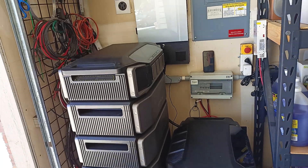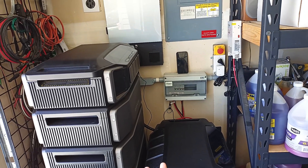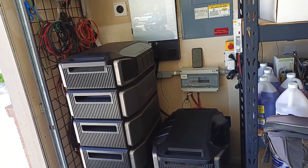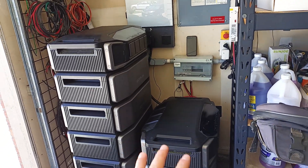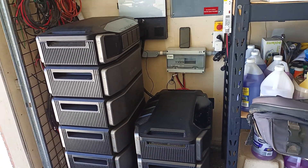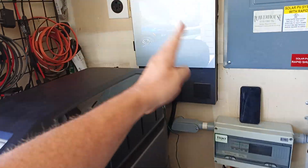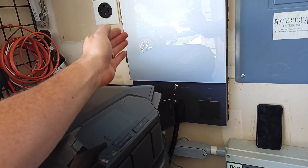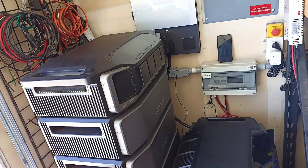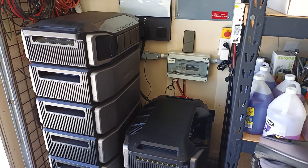Please send me any other questions or comments — I'd be happy to share my setup with you. If you want a one-on-one consultation, I'm starting to do those too, with specifics on the wire gauges and how I ran it. You'll see the links here soon. That's a quick update on my system: seven batteries, two DPUs. I highly recommend at least doing two DPUs for stability — one DPU can take care of one 110-volt side, the other DPU takes care of the other side of the 110-volt in your setup. Just load balance — much better. I would absolutely recommend that. Any questions, let me know. Thanks.